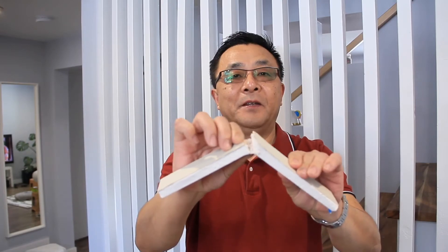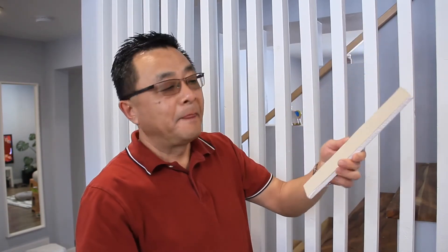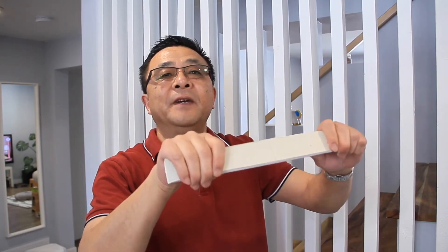It's pretty hard to break this piece of drywall, even if it's only about two inches wide. Crack happens when the tension on the surface is greater than the tensile strength of the paper. Without paper, let's cut this drywall — then it's very easy to break it.